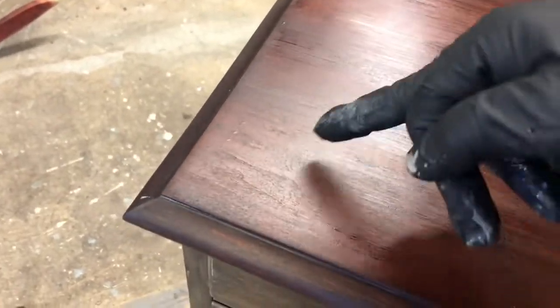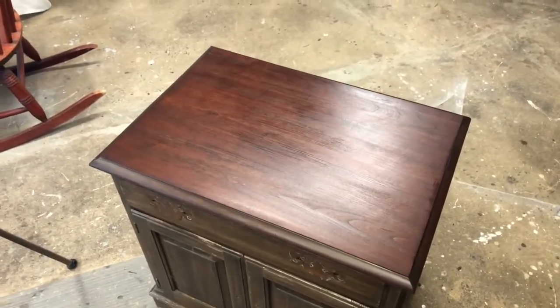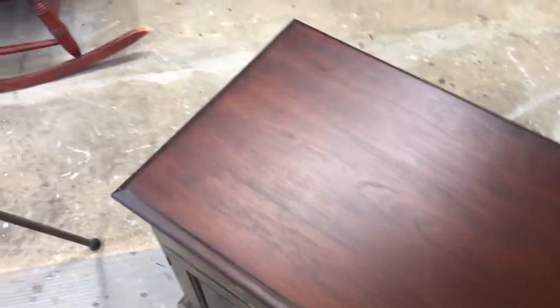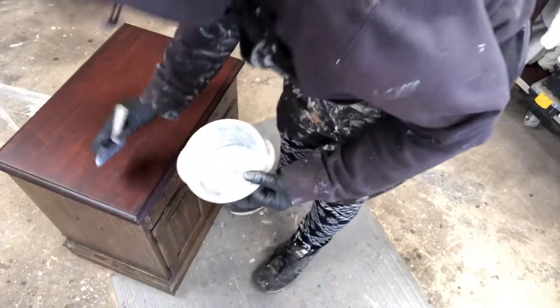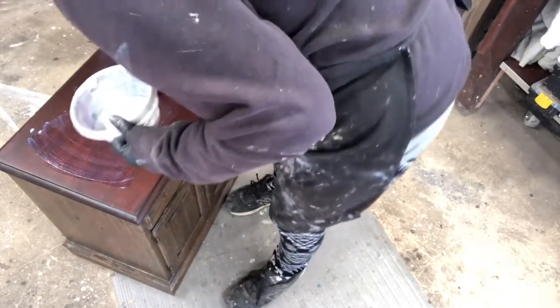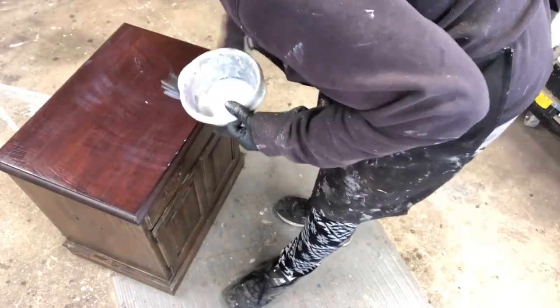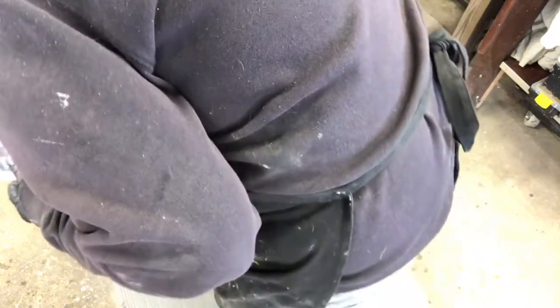You can see the spots here — wet. And you can see where it's drying. It'll probably only take two minutes to dry and you can coat this all day long, as many coats as you want. This has been two or three minutes at most — let's re-coat it again. Don't pay attention to grain until you're done. Just make sure it stays wet on top, and as soon as it starts to dry, don't touch it.